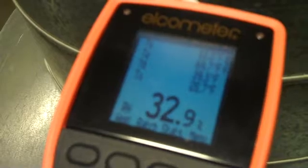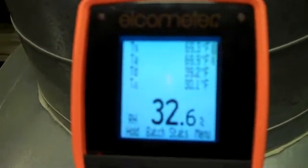It calculates the dew point for you. And if you want to log the data, you can do it manually just by pressing hold, so it'll hold all the parameters at that particular moment and save. Now that data point is logged and it's time and date stamped.